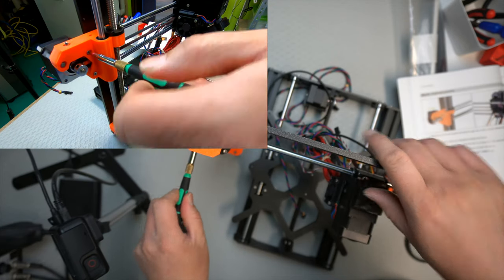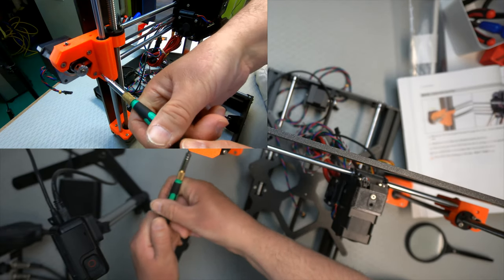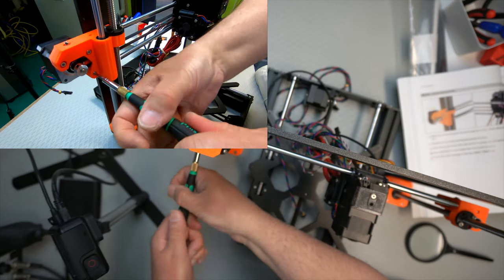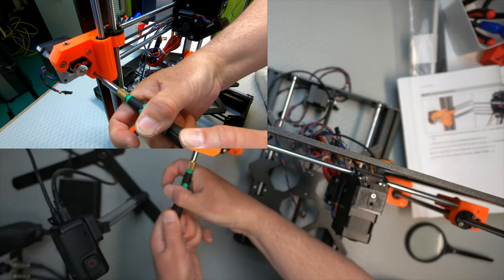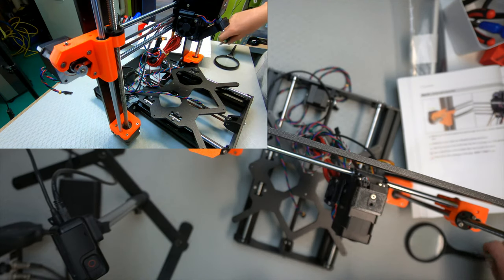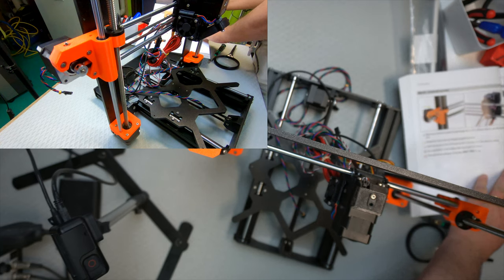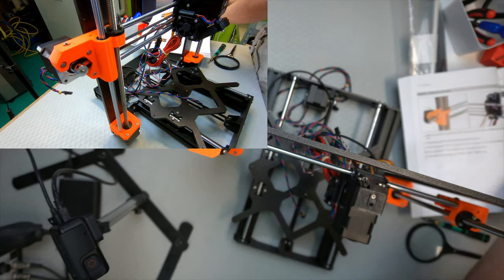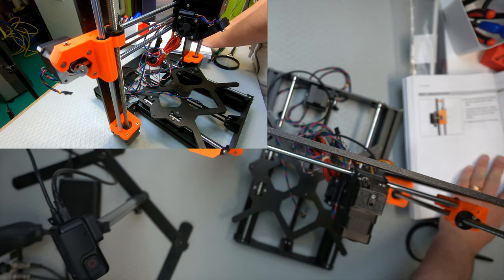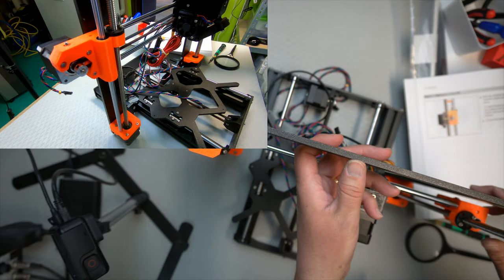Belts always need to be checked periodically and readjusted, and sometimes even renewed, because they tend to wear out. Okay, so that would be that phase. That was step 50. And then 51 is to try and align the spindle.